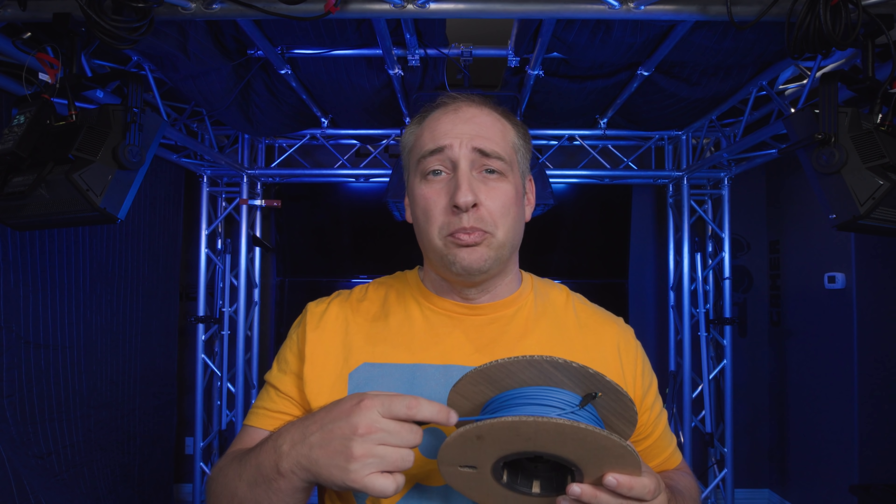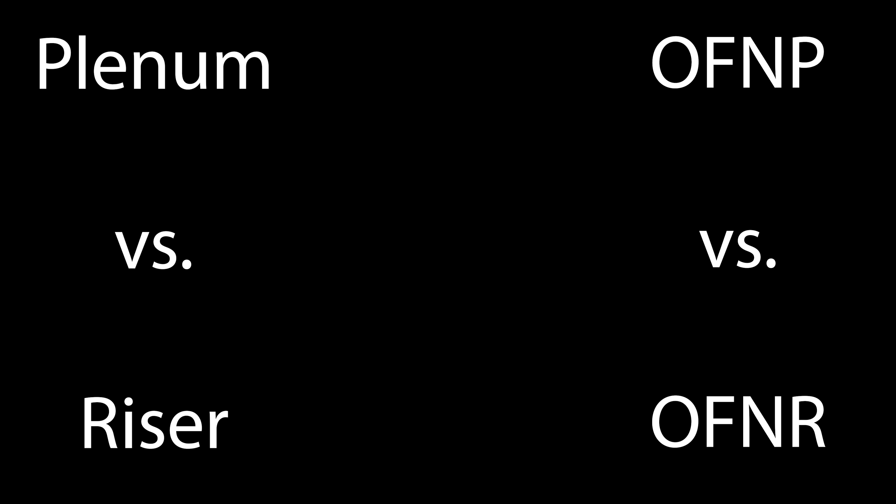Their feedback was that fiber optics are very difficult, especially if you don't live it every day. There's a lot of terminology that gets a little scary — single mode, multi-mode, OM4, OS fibers, LC, SC, MTP connectors, and polarity. But while people love to talk about connectors and specs, what is also important is what goes around the cable — not just the MTP 12 connector, but what this outer jacket is made out of and why it matters. And that brings us to the discussion of plenum versus riser, OFNP versus OFNR, and what the heck is LSZH?